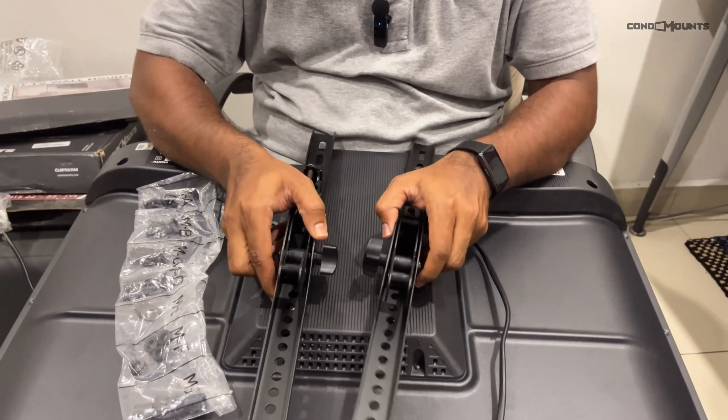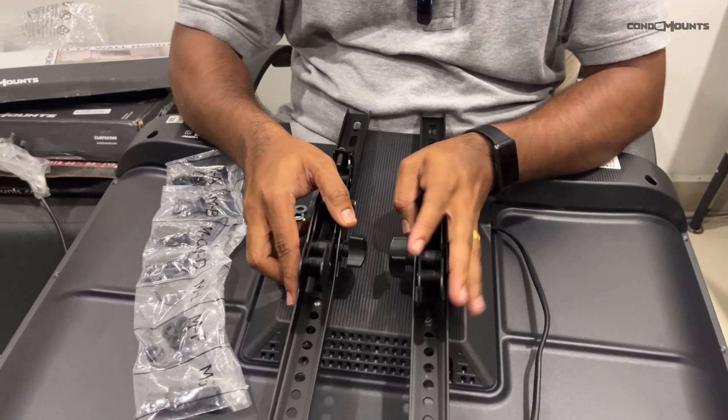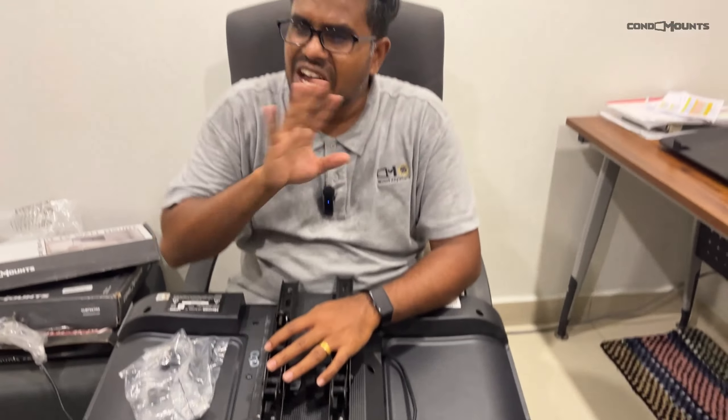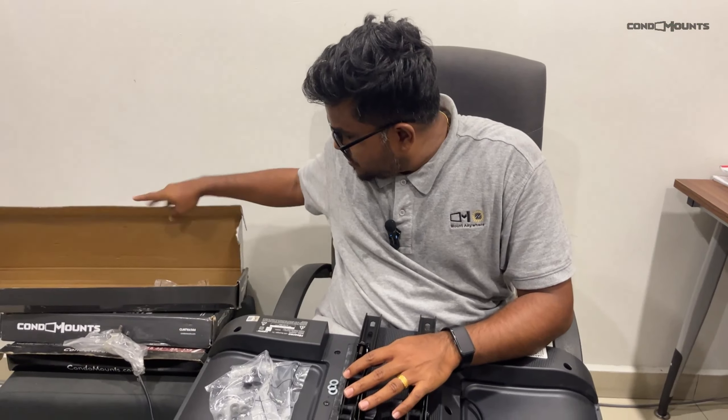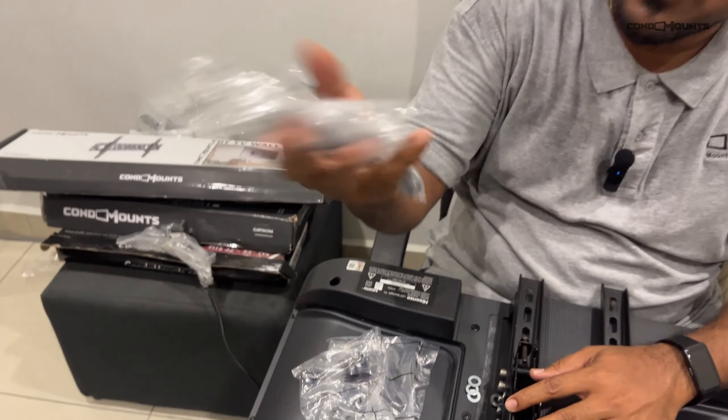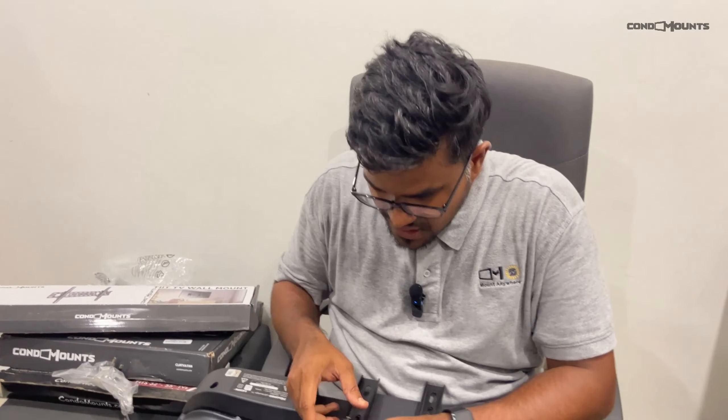Because this is a plexiglass, you can see what's happening behind it. I'll show you so you have a clearer view. I just scan through the drywall and whenever the metal stud finder detects a stud, I bring it up to where I want to mount and make a mark. Then I find another metal stud on the other side and make another mark.